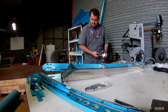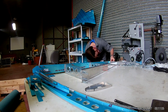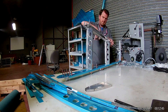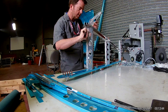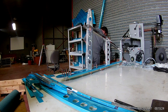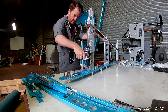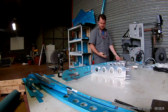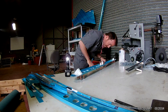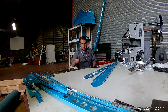There are a couple of interesting holes. What you have to do is final drill all of the main frame holes, which are all one-eighth of an inch, or roughly a number 30 drill bit. There are a couple of spots where you actually need a 12-inch bit but you can't really get to it — at least with my big fat drill. Using a 12-inch number 30 drill bit really comes in handy when you need a long extension into an inaccessible place that you can't reach with the fat nose of either an air drill or cordless drill.